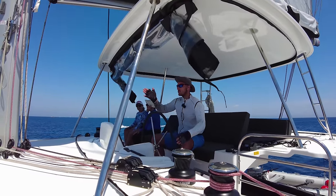Because I don't see well, the person in front is going to tell me when the anchor is out. I have a chain meter, but still, it's good to have a person there to tell you if the anchor is turned around correctly. This is the safety, because these winches get crazy and just release all the chain. Now you put this up so that in case the winch gets crazy, this is going to hold the chain, so you're not going to lose the anchor. Now we're drifting, so we also have to keep an eye not to crash somewhere, because the anchor is gone.